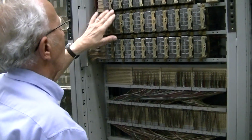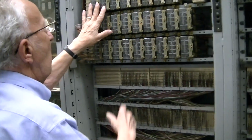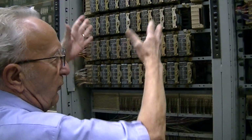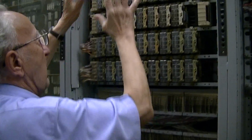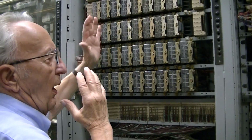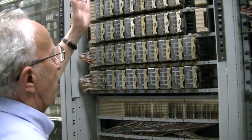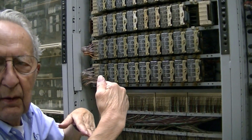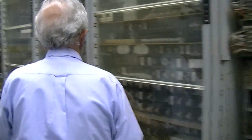Okay. But we only have 1. No, we have 2, or 1. So this is a full complement. That's why there's so many relays. Then the scanning relay, you operate all of these relays, and then the scanning relays scan portions of those depending upon what line you're on, what line you're punching. So that's what this is. Automatic monitor register center test.